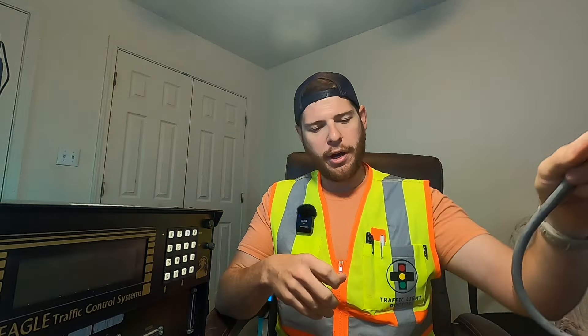You now have a power cable that you can hook up to get your work done - get tactics done, get the controller set up for the intersection you're putting it at, and have it ready to go. You can power your little mock intersection, anything you want. For field techs, you always want to have one of these power cables handy with you. I had an old cabinet laying around and cut this cable out of it. Hope this helps somebody - you definitely want to get yourself one of these cables, keep it in your work truck. It's pretty much essential if you're swapping out or upgrading a lot of traffic signal controllers.